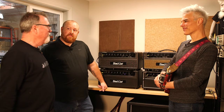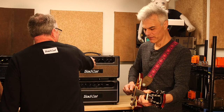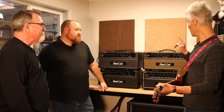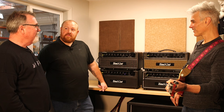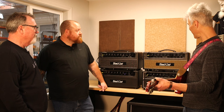The tone circuit is specifically designed to increase the mid-range as you pull the treble back. So if you're on a Telecaster bridge pickup and you want a little more thickness, you just move the treble back a little and the mids come out. Let me turn off the tremolo so you can hear it. Although you don't have a dedicated mid-range control, it is there — that's a really clever way of doing it. On most amps, rolling off the treble just darkens it; it doesn't fatten it up.